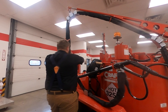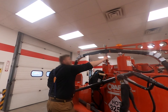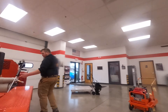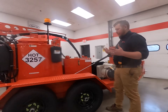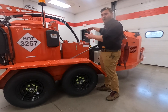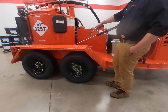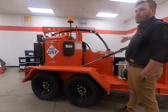Something new to our equipment is this boom system. This piston allows the boom to come down and be put up, so when you're working out at a distance it will stretch a little further by flexing downward, and as you come back toward the machine it lifts, taking weight off the hose and keeping it from dragging. This essentially operates as that second person a lot of guys usually have helping with the wand and hose. It keeps the hose from dragging, out of harm's way, and prevents tripping. They did about 300,000 flexes before showing any signs of wear on the piston.